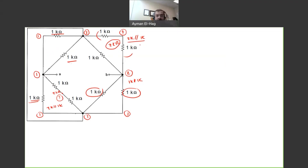For 2 kΩ in parallel with 1 kΩ: (2 × 1) / (2 + 1) = 0.67 kΩ. The same applies to the other 2 kΩ ∥ 1 kΩ combination — also 0.67 kΩ. For the 1 kΩ ∥ 1 kΩ combinations: when two equal resistors are in parallel the result is half, so each gives 0.5 kΩ. This completes the first round of circuit reduction.